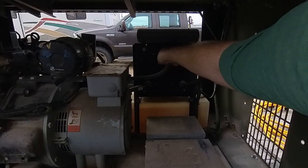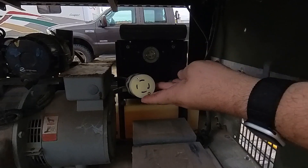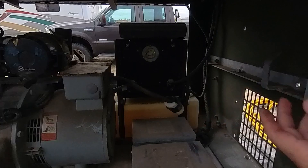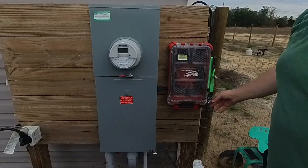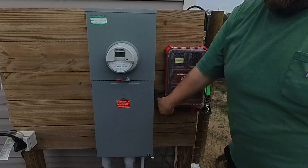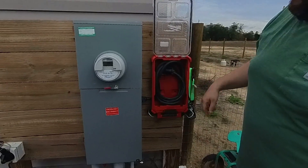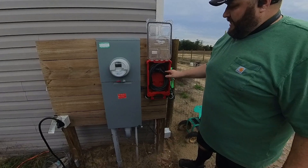To prepare to connect it to the house, the generator plugs into the back of this circuit panel, but we need the whole voltage from the generator, not just 120 volts off the front, so we're just going to disconnect that. I've set up the cable for our generator in this Milwaukee Packout box to help keep it out of the elements. It coils up in here real nicely and that gives me about 12 feet of cable.